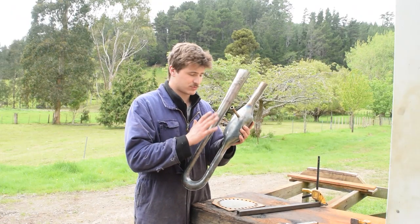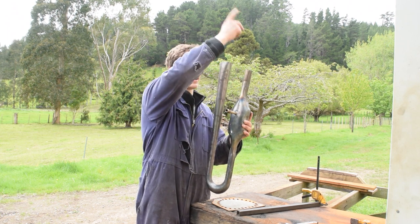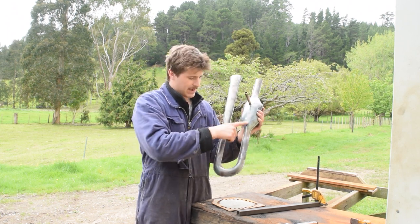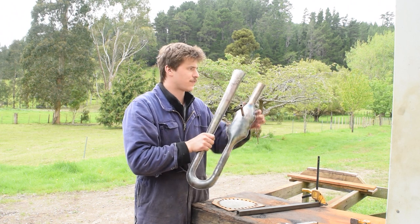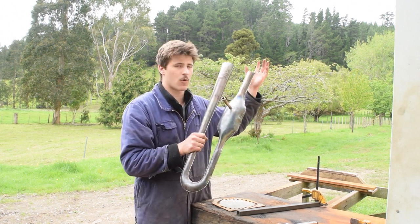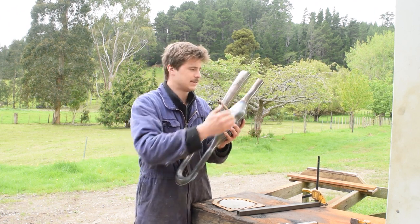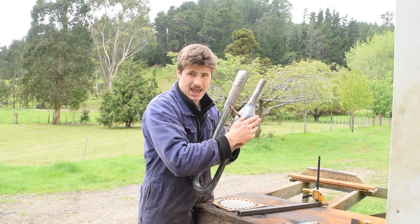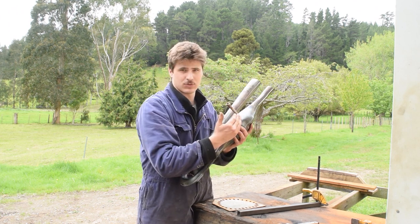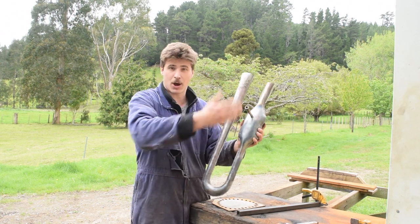The way a pulse jet works, really roughly, is you have your explosions in your chamber here. The hot exhaust gases go out this end and down this tube. Now by the time it's halfway, it's fully exhausted. It's now got a low pressure zone inside the combustion chamber, which is drawing back in fresh air as well as the hot exhaust gases. By the time the hot exhaust gases get back into the chamber, fresh air and the fuel have mixed together and that hot air reignites, and then that creates your pulse cycle.